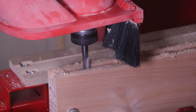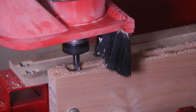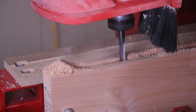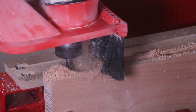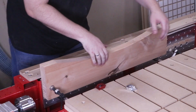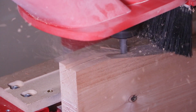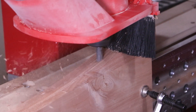A dowel method isn't bad, but those doors can't last as long as a deep mortise and tenon. If you want something really robust that can last a long time, having the ability to add these custom joints takes your project quality to the next level. Now let's look at that arched rail — how we apply the dado slot. It approaches it the same way: the cutter follows the flat surface and then follows along the dish of the arch, repeating for the entire sequence.